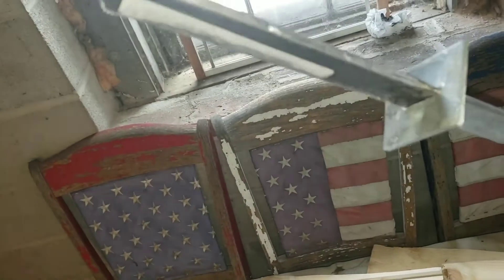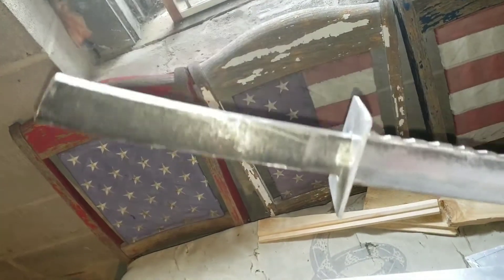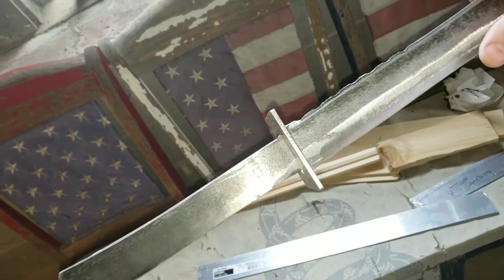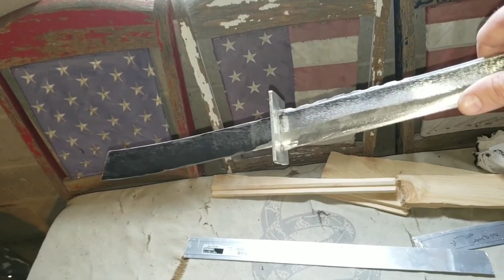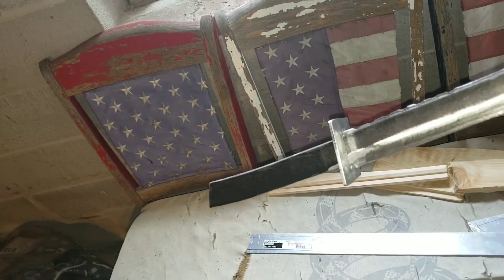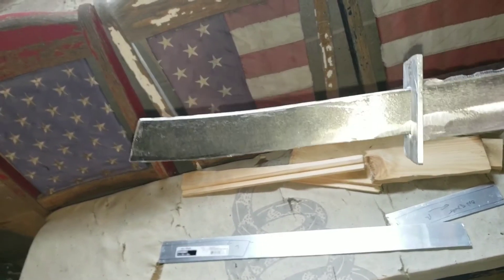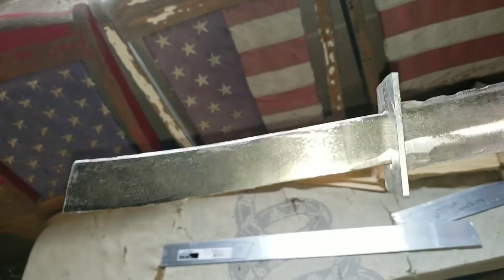I used a file. First I took some aluminum, I cut it down at a couple of angles — I didn't want it perfectly square. So as you can see, it's like a parallelogram. All I did is I drilled a couple holes in it and then I used the cutoff tool to make a line, and then I took a file and just filed the hell out of the center. I now have my guard, and I think I'm gonna do aluminum scales. It's gonna have aluminum guard, aluminum scales, aluminum pins. I'm pretty happy with it so far.